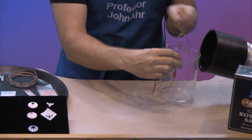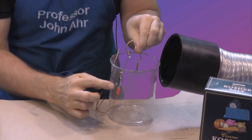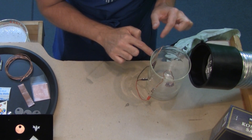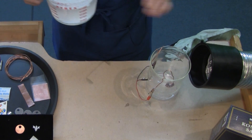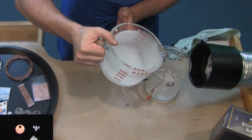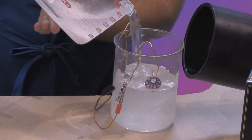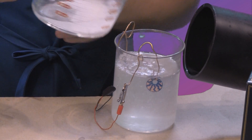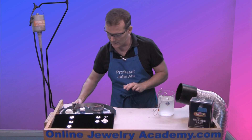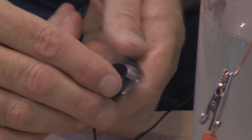I'm going to use the one with the blue enamel paint and put it onto the positive terminal. I do have my piece of scrap copper attached to the negative terminal. Next I want to fill my glass or plastic container with a highly saturated salt solution — you can boil your water in the microwave or on the stove top and dissolve as much salt into it as you possibly can. When you fill the container, just make sure that your project is completely submerged and that the negative area is also completely submerged. Now I need to connect my power source and make sure I've got the right terminal connections.